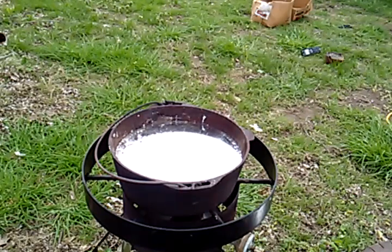When you get this kind of thick-looking layer on top, that's generally going to be your antimony or whatever other metals you have mixed in. What that tells me is this is not quite hot enough, so let's turn it up again. For those of you wanting to use infrared point-and-shoot thermometers — that does not work on this because it's a mirrored surface. What you can do if you're using a cast iron pot is shoot the pot and get a temperature off the pot, because whatever the outside of the pot is, the inside is going to be the same.